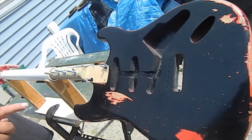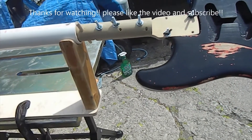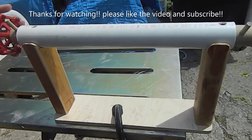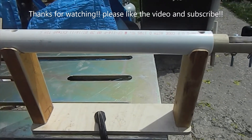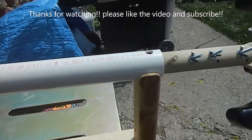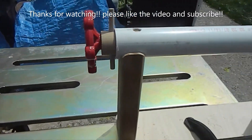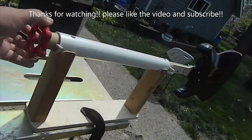Let's give you a quick walk around of all this. There's birch ply, a poplar rod, a piece of PVC, two two-by-threes, another piece of birch ply, and a giant plumbing valve to turn it. And a couple of dowels in there just to keep the rod from going in and out and dropping the body. There you go — an easy to make, very cheap to make guitar rotisserie for painting your guitar.